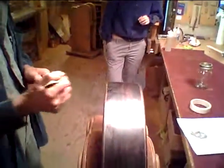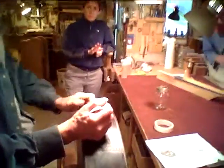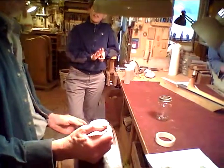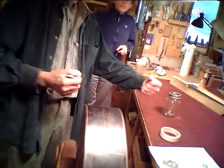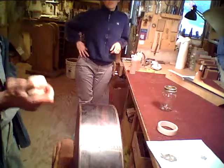Anyway, we did that for years, and what was happening quite a bit with our guitars, now and then you have to put masking tape on here and there, and we'd pull the masking tape off, and everything would come out of the pores. It wouldn't hold. The shellac over those filled pores would just pull all the pumice out of the pores. The alcohol is no carrier. So then I started putting shellac in the filling pad, about half and half with alcohol, and since then I haven't had that trouble.